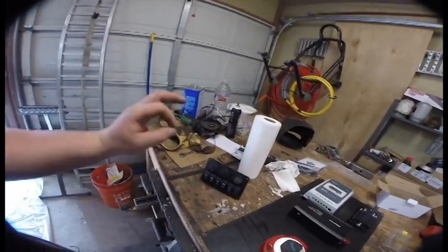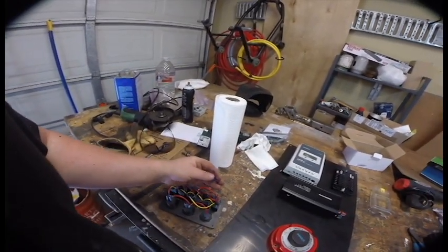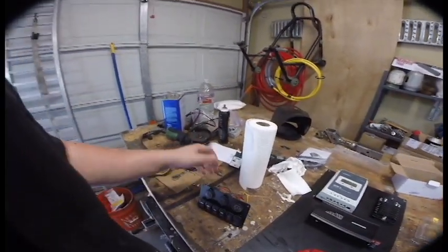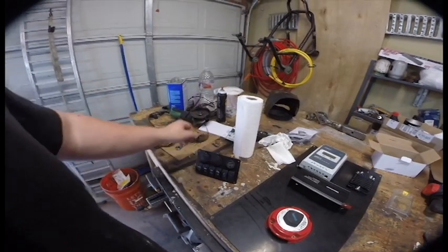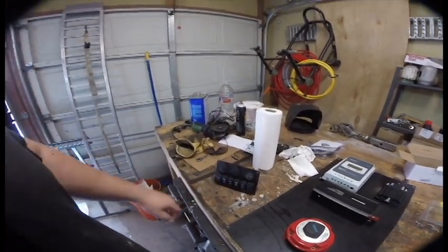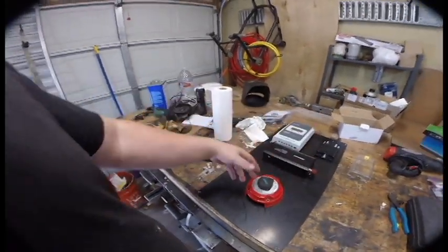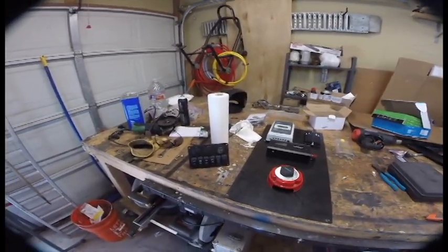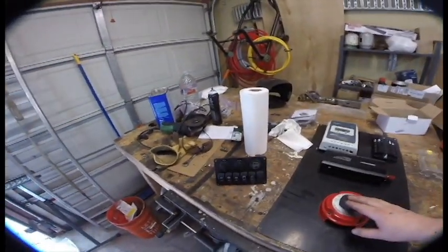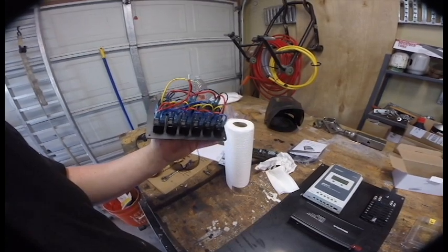This is our outdoor fuse panel — it's an aluminum, waterproof panel. The switches are waterproof. They came with some labels on them but I'm going to put proper names on them. We have six illuminated switches. The illumination is on one circuit and the actual power is on the other. It has USB ports built in, a standard 12V cigarette lighter-style port, and shows a voltage reading. All of this — the backlight and features — will be controllable from inside the trailer so we can lock it and nobody can mess with the switches.